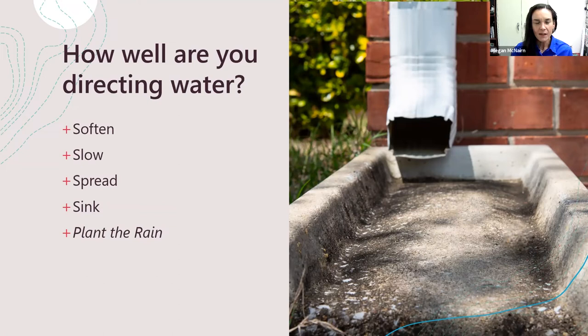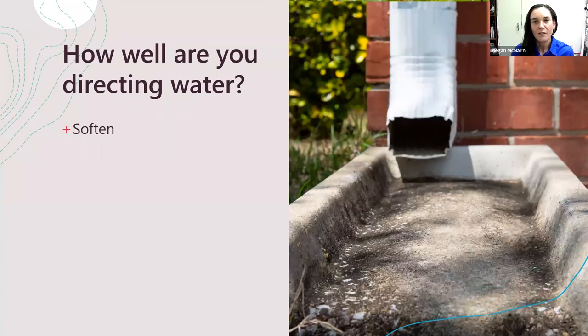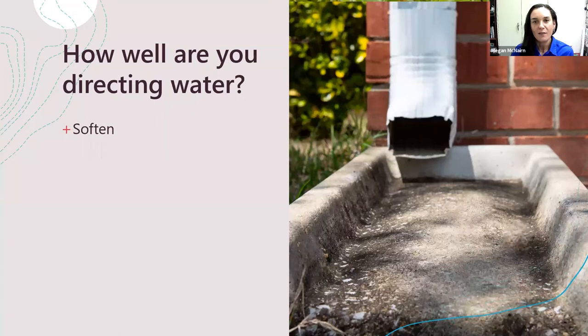If you've got one of these downspout bumpers, please install them in the correct orientation with the bumper at the back. I see them turned around so often with the bumper at the front, and that just retains water but has no plants to help pump that water out, so it does create mosquitoes. Put the bumper at the back — they're meant to keep your yard from having a big eroded hole in your lawn, so it softens the flow of water but really does not much else to help you effectively direct that water to your landscape.